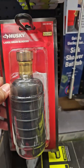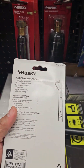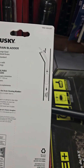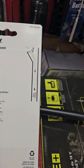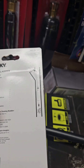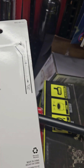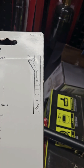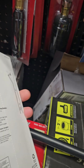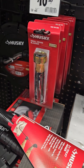That large bladder can probably handle up to a six-inch drain pipe — four to six inches. What you do is connect it to your water hose and put it down the pipeline. I would not recommend using this inside your house — it'd be something you do outside at the clean-out. You put it down there, turn on the water hose, the bladder inflates and forces water through. Same concept with the medium and small bladder.